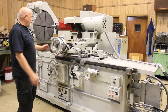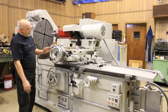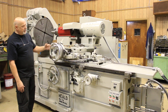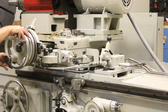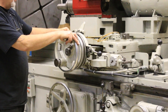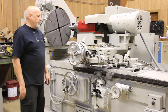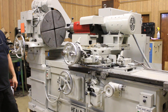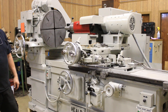If you want to get this thing to feed, once it gets to zero it comes around. When it gets to zero, there's a ramp on the hand wheel that lifts the pawl away from the ratchet, stopping the in-feed. So when you want to start over again, you lift this up and come beyond that. Then each time it reverses, you see how it feeds. This is the automatic feed.